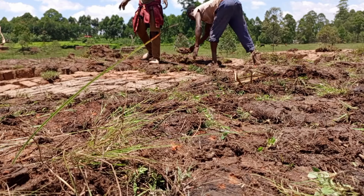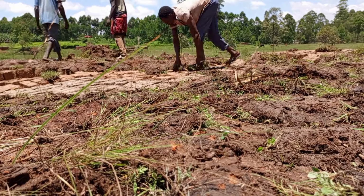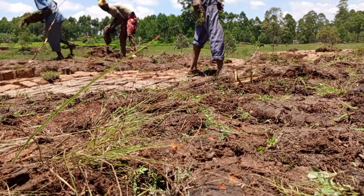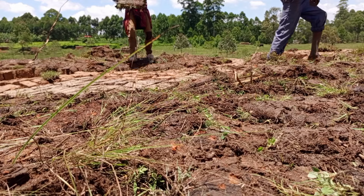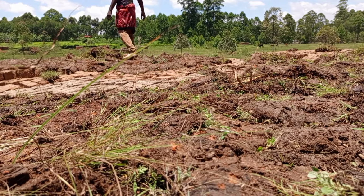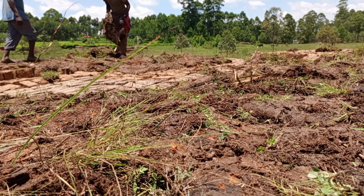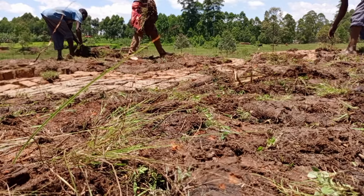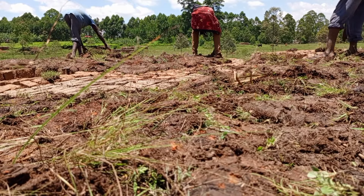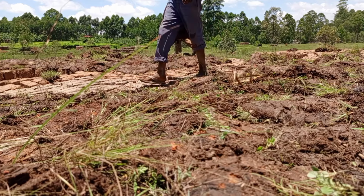Yes, this is the top layer where these things are covering from the top, so that we prevent a loss of heat as well as the direct contact of rain from the lane. So we have to cover them, and we cover them evenly. If we cover them unevenly, then some bricks from the top may be burnt and the rest which has not been covered evenly may fail to burn well. So we had to do it well.